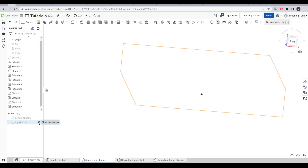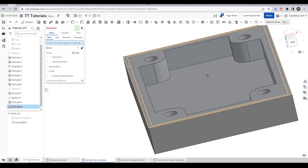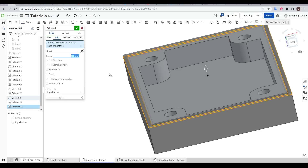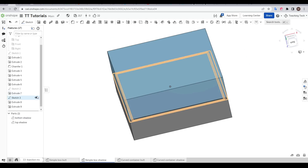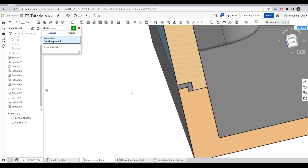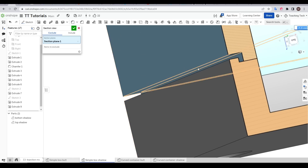Let's finish that with a tick, hide the bottom piece and show the top piece, and also click to show the sketch we created once more. Now one more Extrude — this time selecting only the outer portion and extruding only up 0.5mm. We can hit the tick to finish the Extrude, and that's all that's required for the upper half. There's our shadow line complete. Let's turn off this sketch and inspect it by adding a section view. If we zoom in, we can see our shadow line — the internal surfaces mate as before, but on the outside we have this overlapping lip with a small gap in between the two parts that will create the shadow.